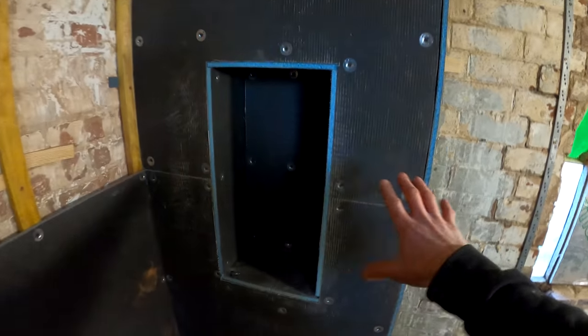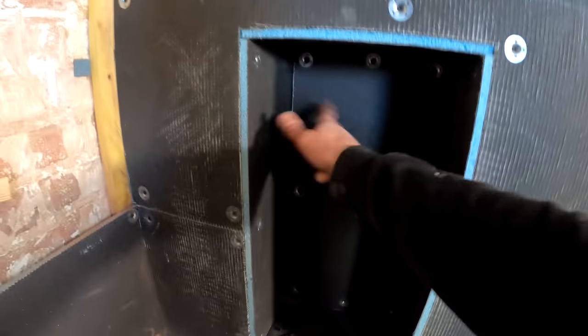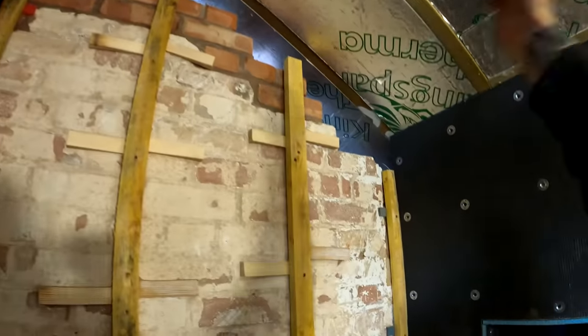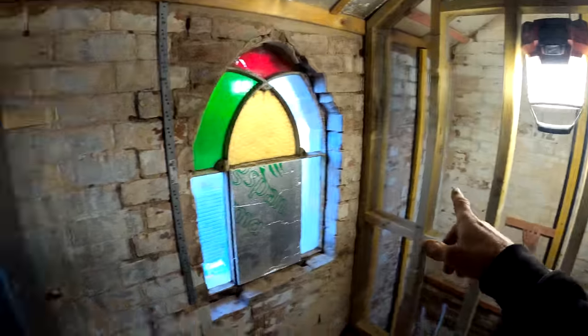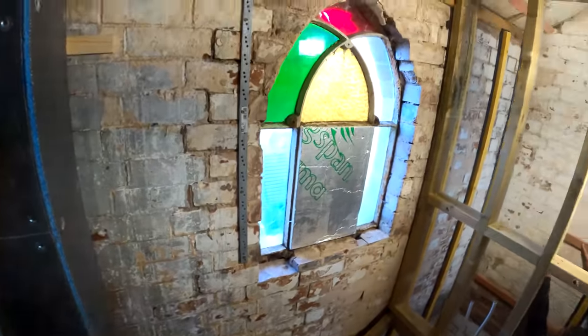The niche is done. You can see in here this is all being almost boarded. Obviously we need to get our tape on all these edges and these internal corners, but that just gives a nice little area there - we've got a shower from the middle and you can get all your shampoo and shower gel in there. I will do this extra board here once the ceiling's been boarded, so we're going to actually cast the board right the way through - that's why we've left this down like this, and I'll complete that once the ceiling's on. Next up, following on from what Pete's been doing out here with these battens, I'm going to carry the battening in here and get all these on - just another job to wipe off the hit list.